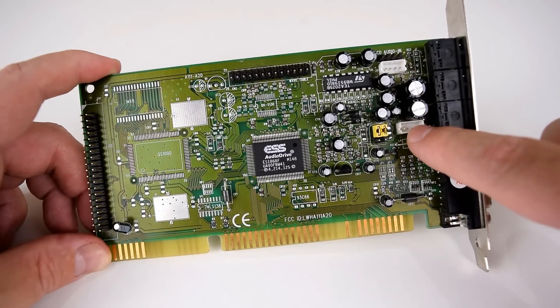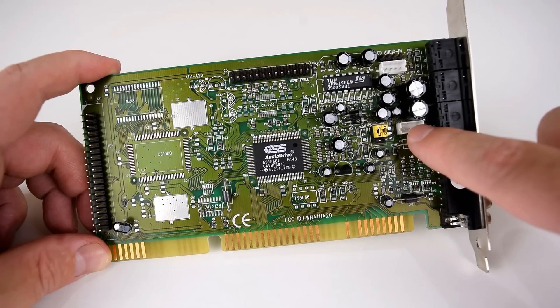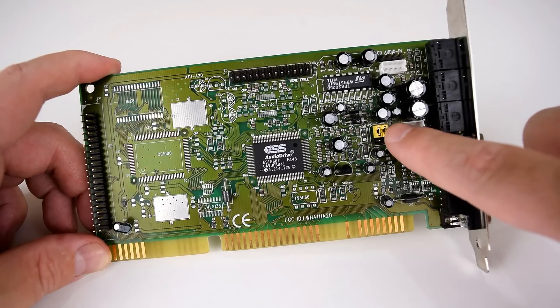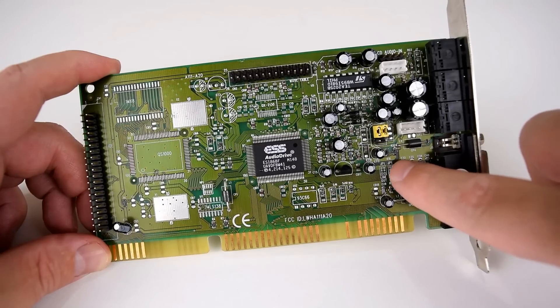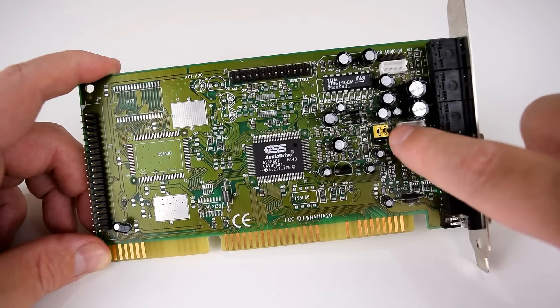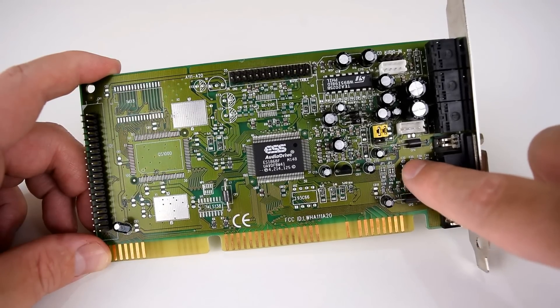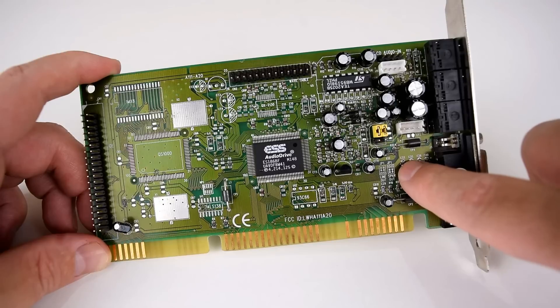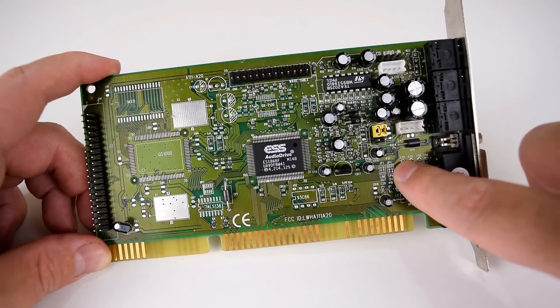That one didn't work for me. I connected the CD audio cable and I could hear some faint music playing, but it didn't really work for me, so I'm not quite sure what that connector is for. Here we have two jumpers that have to do with the amplifier. There's a little picture — line out, speaker out. So if the jumper's at the top, it disables the onboard amplifier, and that's what you want if you're connecting powered speakers or an amplifier. But if you are using passive speakers with no amplification, then move the jumpers to the bottom and the onboard amplifier will activate.